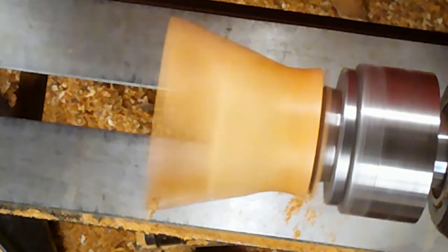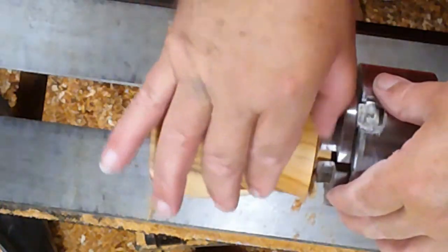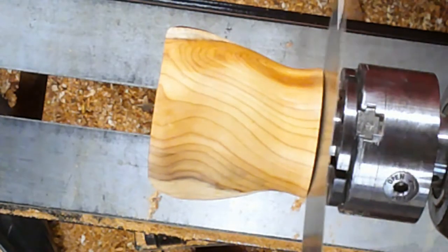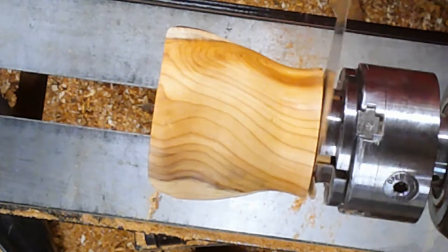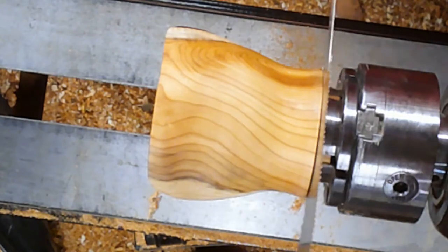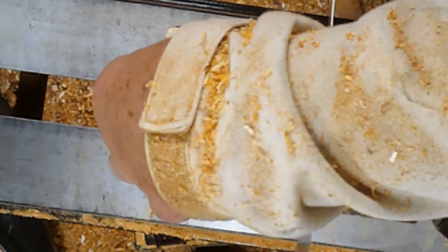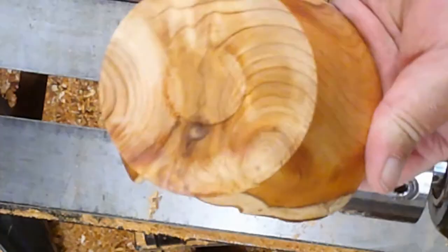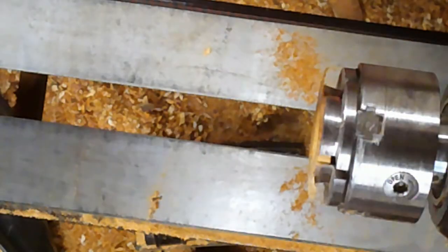I want it to just sand over the end, just so I had nice, and you can see how sharp that U is. It's actually not ripped, it's actually cut straight through my abranet. You see what a sharp edge that is on there. What I want to do is just bring that over, just make it a nice soft edge so that if anybody picks it up, it feels nice.